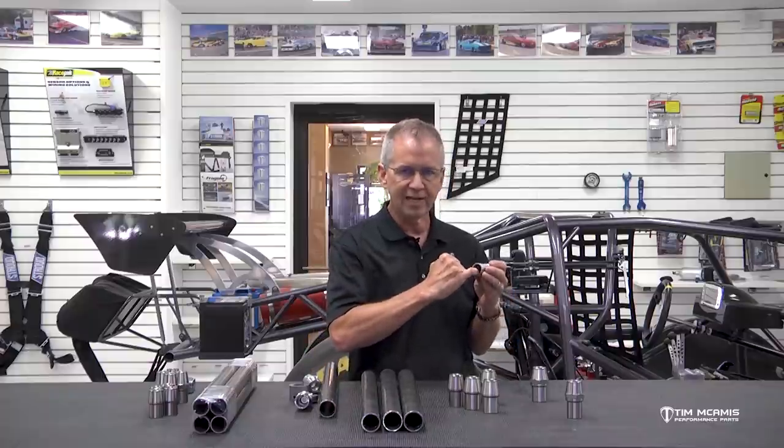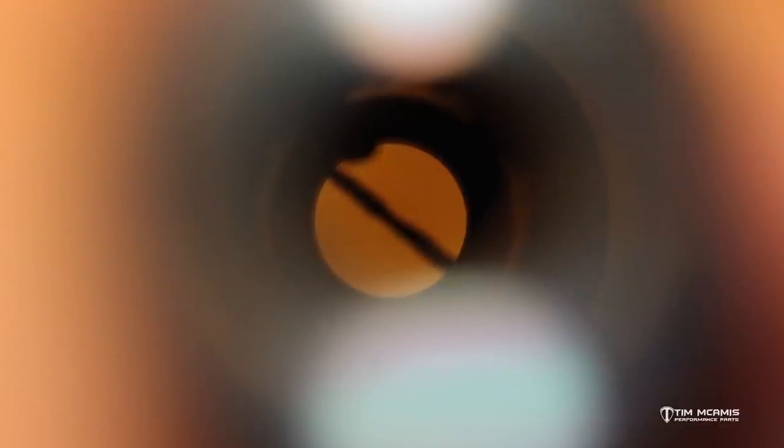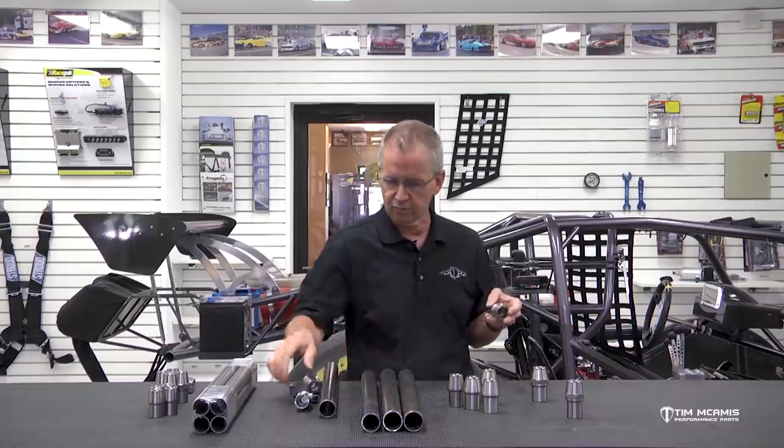If your rosettes are good and your rotational weld is good, you're perfect on this bar — but make sure they're right. Look down in there when you're done and see a hump with actual rod visible. When we weld these up here, the guys push the rod in so hard they'll actually push a piece of rod through to the inside — you can see it hanging down in there. It doesn't matter because the threads can't get down that far, so it's not going to affect anything. Even if you do get a little push in there, it's not going to hurt a thing.